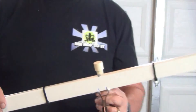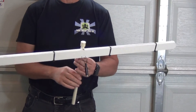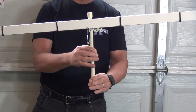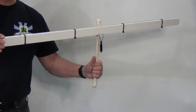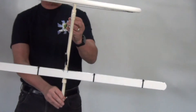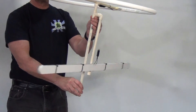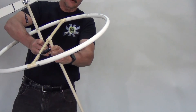This antenna is complete. I screw a matching transformer onto the terminal ends and it's ready to use. You can use this as a standalone antenna or attach it to a UHF antenna to give it VHF low capability. Here it is attached to my UHF hoop antenna. I like to keep things compact so I prefer installing it hanging below the antenna, but if you want to install it above you can easily do it like this.